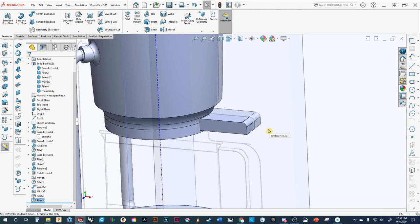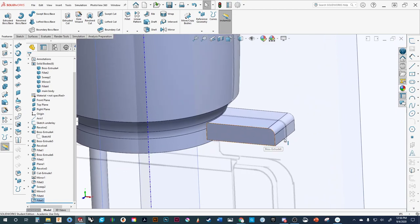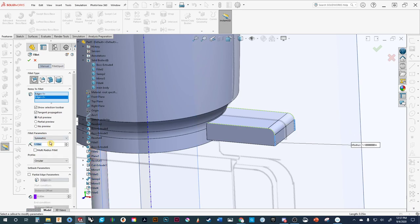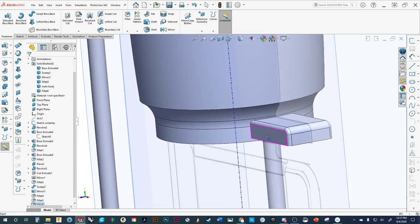Let's come down here and put a little bit of form to this. We'll add some radii — we're going to do a chain radius, so you can see how it automatically accepts that. We'll do another chain radius, keeping it as a constant radius. Let's come in and instead of doing asymmetrical, we'll do symmetrical. You can see how that's getting a dotted line — by default, this radius is way too high. So we've got to get it way down. We'll hit select, and now we start getting that shape.